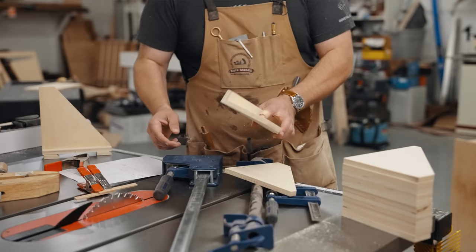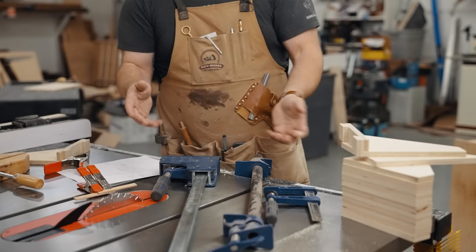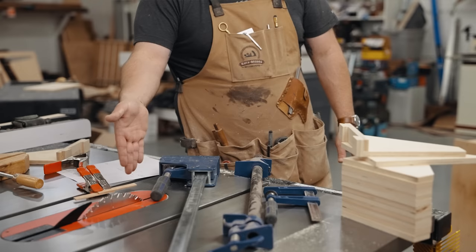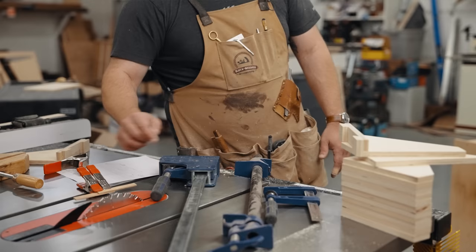If you want to take your squeeze clamps and just clip them on, or if you have those wooden parallel clamps, you can make something that is really far spaced apart — it'll give us a ton of flexibility. If you're using a full sheet of Baltic birch, that should give you 17 inches left and we're just going to cut that all into cleats. I recommend one and three-quarter inch minimum to two inches for your cleats. One thing that is very helpful when you do your cleats is to use something to press down on it from above, like attached to your fence, because when you're cutting a 45 on a rip cut there's a tendency for it to lift up and you'll get a wavy cleat. If you're a perfectionist, put something to push it down and it'll give you really even-looking cleats.